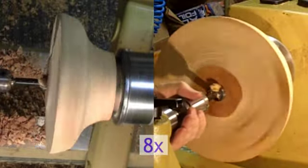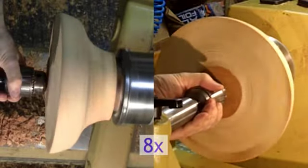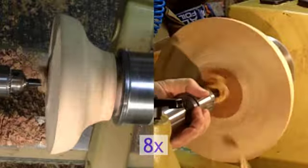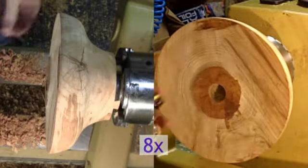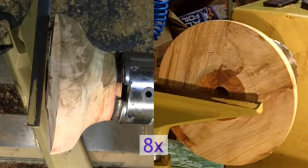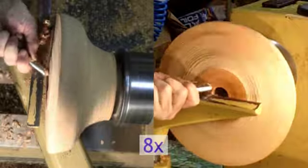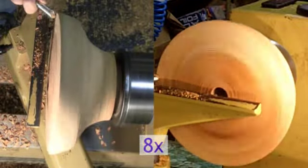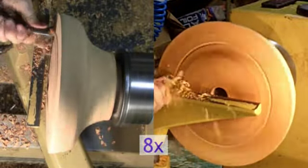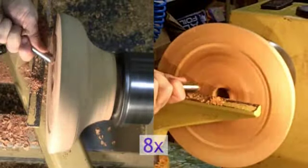After about 18 one-hour cycles at 10% power, the wood was barely warm at all. So I cranked it up to 20% power and did another 14 one-hour cycles. I got a lot of water out of it. The original weight was 2,040 grams, and after all of the cycles it was 1,813 grams. That's only an 11% loss, so it's obviously not enough.